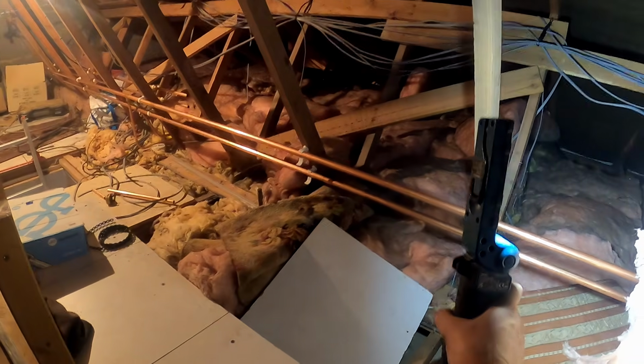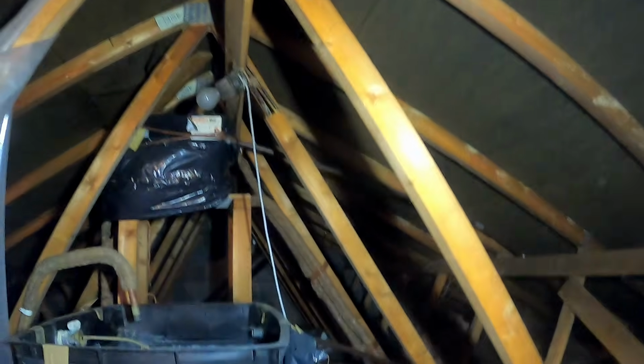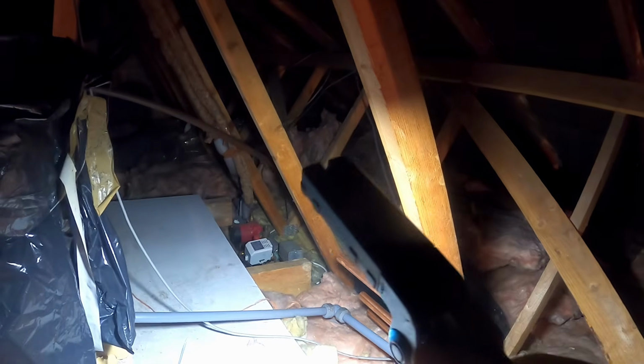That's our kitchen drop. This is as far as we're going to take these 22s this side, so just going to join them 15s onto the 22, and then them 22s will just pick up the lounge rads, so there's just two in the lounge. So all this side will be done, and then I haven't got enough copper to finish that, but as I've already said, we're going to get that sorted. They've actually put the pumps in, well there's the pump, one of them will be for heating, one of them will be for hot water, probably that, I don't know, I'll have to go over there and have a look, but there's a Drayton one there and there's a Honeywell one there, so yeah, we'll just get it sorted.